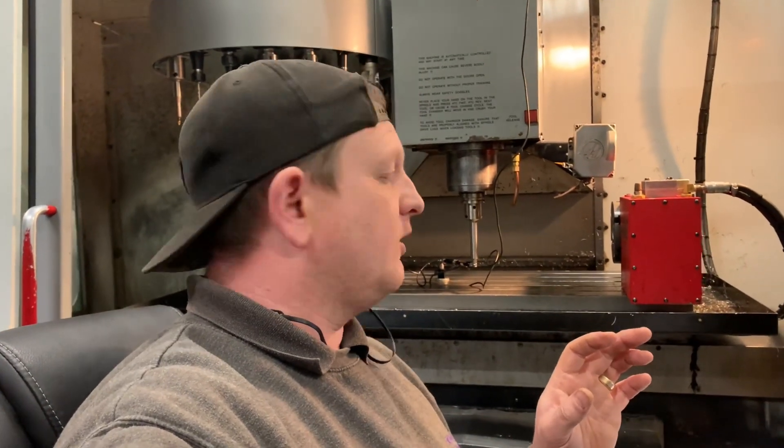When I first bought this kit, I ran one on the other machine but didn't really know what I was doing. With this machine, I'm trying to level it, I'm trying to get it dialed in. Obviously everybody wants their machine to be as good as it can be for its age — this is now 25 years old. So I leveled it with the levels I had available, which was one machinist level, which was pretty good. I couldn't get it perfect but I got it as good as I could. I've also been speaking to Aaron and he's been telling me how to dial out errors that these tests show. I've done this for pretty much a day and a half, whilst the other machine has been running doing some parts, I've been sat in this chair with this laptop on this machine, dialing out errors.